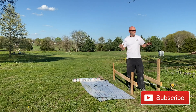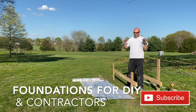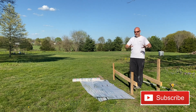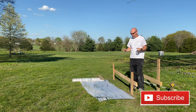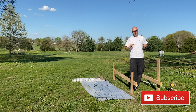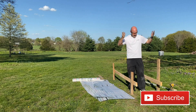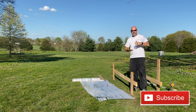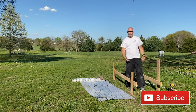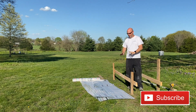Today I want to show you some semi-ICF related stuff, more for DIYers wanting to do their own foundations and ICF walls, and really any contractor using best practices. I absolutely love this product and we've been using it for quite a while. It's called the Fast Foot system by a company called Fab Form. It's a waterproof fabric that goes under your footer to create a waterproof membrane — because all that effort you spend waterproofing your wall is counterproductive if your footing is sitting in wet soil wicking moisture up into the wall.